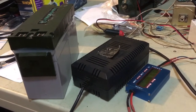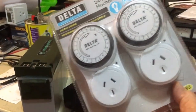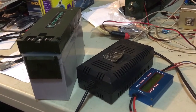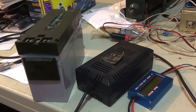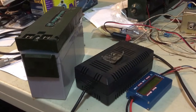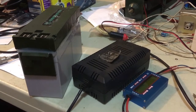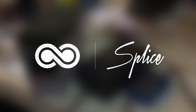When fully charged, the monitor reads around 0.3 to 0.4 amps. To be safe, I use a plug-in timer set for four to five hours depending on how flat the battery is, to ensure the charger turns off automatically and doesn't keep going. I've been using this method for years with all my repacked SLA batteries - it works brilliantly and is a very cheap charging solution. Thanks very much for watching - I hope you get value out of it. This is Victor Kilo 2 PRC, saying 73, catch you again, bye bye.